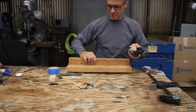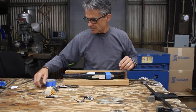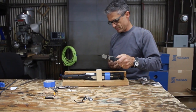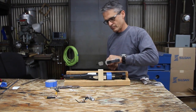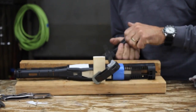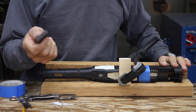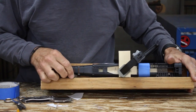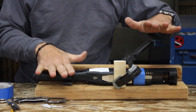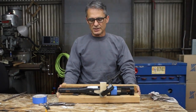And now from this point, you'll take your right angle. You'll place this just like that. Take this other shape. Then you'll take either your C-clamp or your wood clamp, make it nice and tight. And I also like, you can get a piece of wood or some sort of a metal shim, or really any kind of shim, and put underneath here, just so the whole piece, as you drill this, it can't shift at all. So what we'll do now, we'll take this work over to the drill press